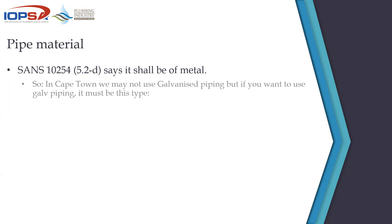What we used to call light galvanized piping — sold over the counter at many retail stores — is a very light gauge galvanized pipe that doesn't comply to any standard whatsoever. It's not a recognized piping system. Yes, it is of metal, but it doesn't comply with requirements such as changes of direction or minimum internal diameter. When reading standards, you can't just take one phrase and say it ticks all the boxes — there are many more boxes to tick.